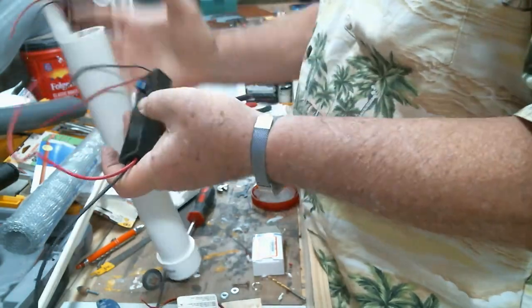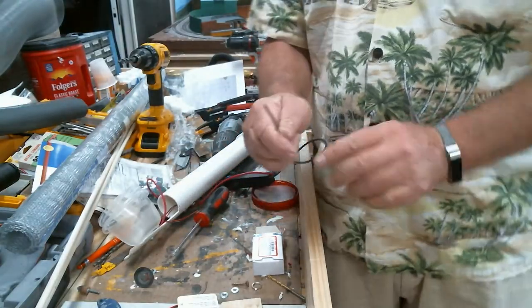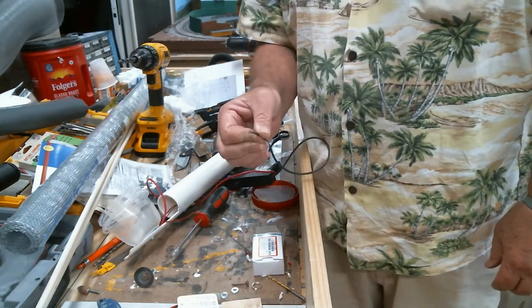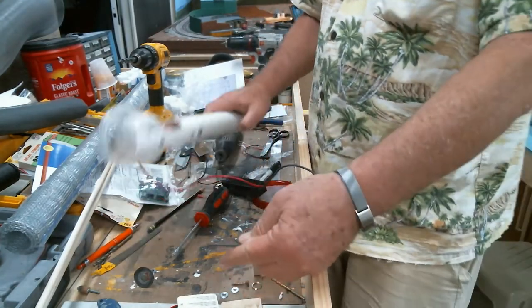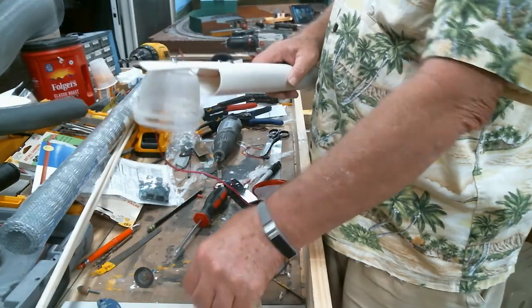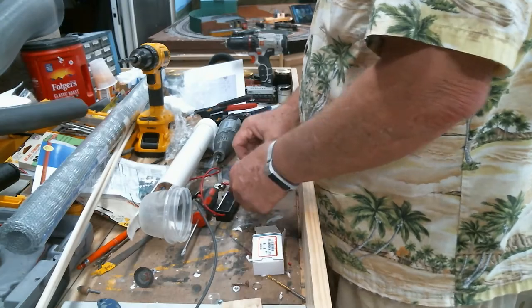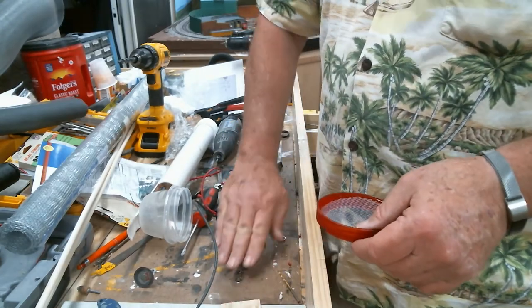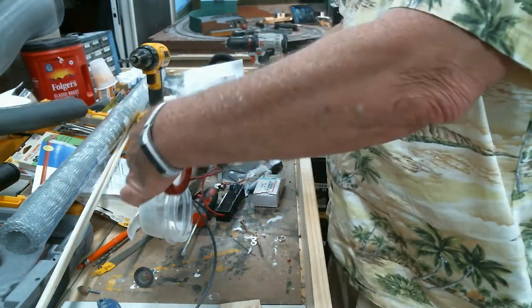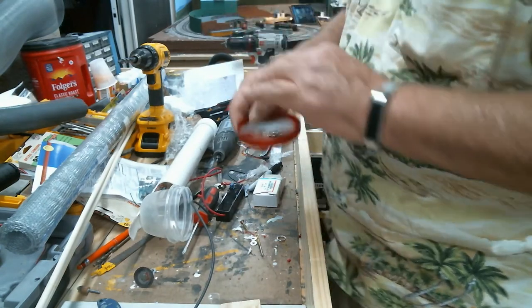Alright. So, that's one side. These are the big wires. This, I'll extend and put an alligator clip to. That will be our field to create the static charge that the static grass passes down. So, next step is to epoxy this screen into the lid. Even though it would clamp on, it'll just make it a little better.